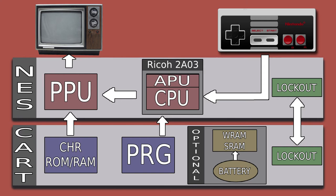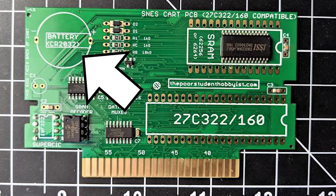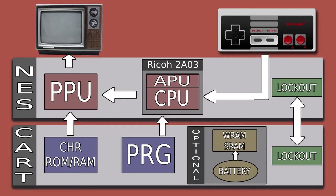RAM is a volatile memory, so if the power goes off it loses all the memory. In order to save all your data, the idea was to include a battery to keep the power on the RAM — as long as the battery lasts, you retain your save files in your cartridge. That's the saving method used in NES, Game Boy, and Super Nintendo games. Of course, you don't have to have a battery — you can just use the extra WRAM for whatever additional memory you need for your game.